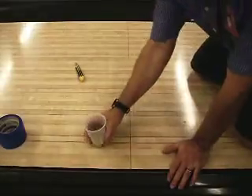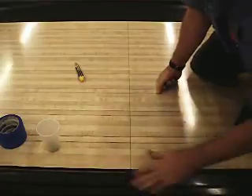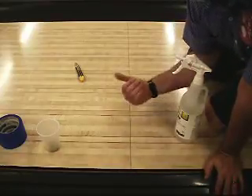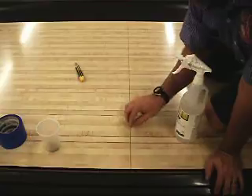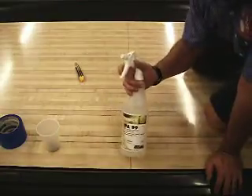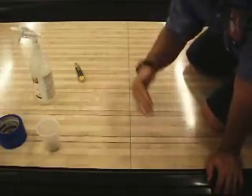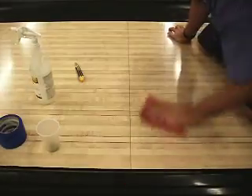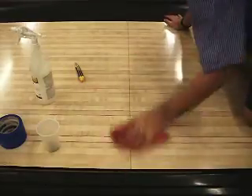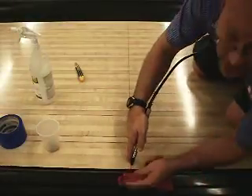Now I've got all the old sealant out of the lanes — you can see it right there. I'm going to go ahead and spray the seams. When you cut the sealant out you'll sometimes have congealing oil come out from the conditioner, especially if it wasn't sealed well enough. So I'm going to spray my IPA 99 right down into the seam to clean the side walls, wipe it down so it'll be clean for the tape, and then blow it out with the air compressor to dry out the IPA 99.